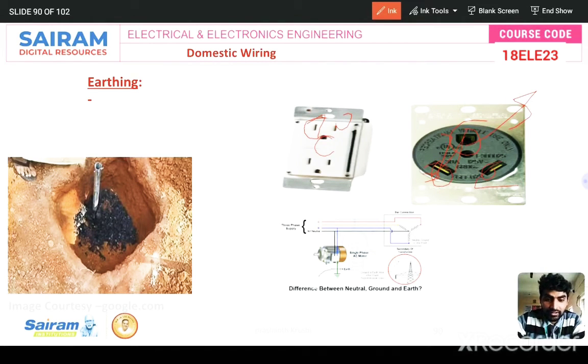So this is the earthing done for the motors. Okay, this is your three-phase supply. This is phase and neutral if it is a single phase motor, and the equipments must be earthed. The body of the equipments, the cover, must be earthed to eliminate hazardous situations, so that the person who is operating should not get shock. The equipment should operate according to requirement, with no damage and no losses in the equipments also. This is three-phase supply, just for understanding purpose.